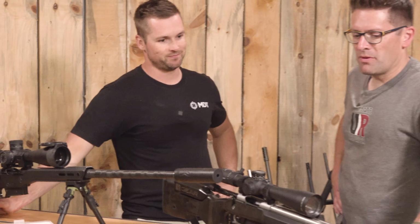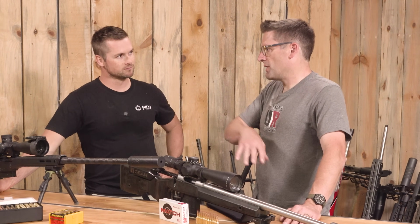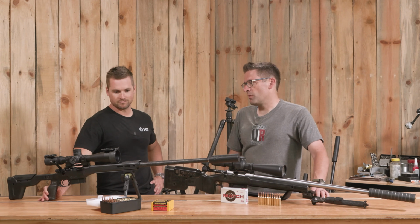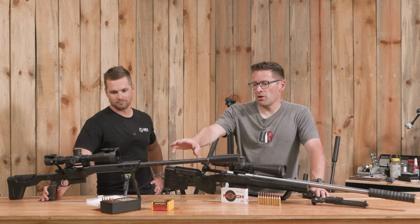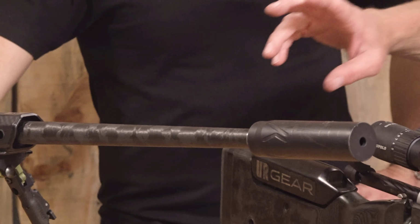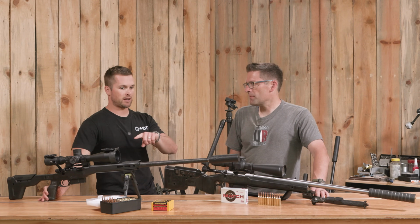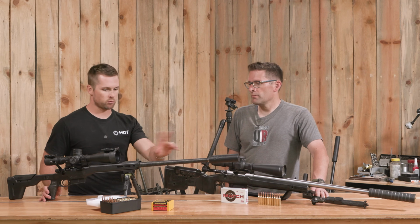Yeah, and I've been developing some tools for getting all of the detailed machining step planning done in one fell swoop. Sherman was great about getting us the reamer print for the 6.5 Sherman Short. So we've got the Wombat, we've got a Carbon 6 barrel. This is 26 inch, 1 in 8. And is that similar to the setup that you're running in South Africa? Very similar. On that one I had an IBI carbon fiber barrel, the International Barrels as they're also known, also 1 in 8.